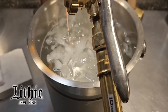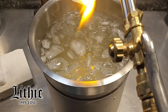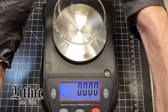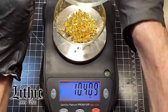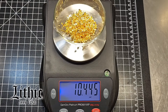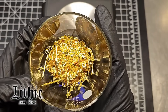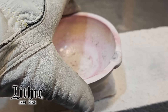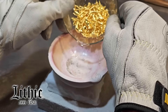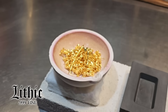I'm going to pour this into shots and get a weight. Folks ask me quite often why I don't pour it directly into a bar instead of pouring into shot first. I want to take the total weight and calculate what it is — we have 10.444 ounces, a little just under 10 and a half ounces. But I want to pour a 10-ounce bar, so I re-measured and got precisely 10 ounces, going just a hair over to make sure.